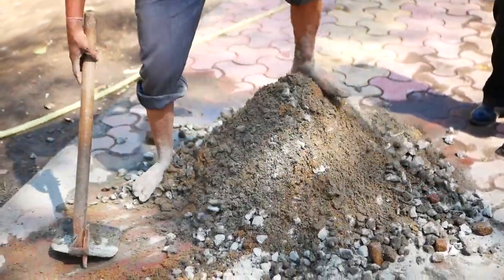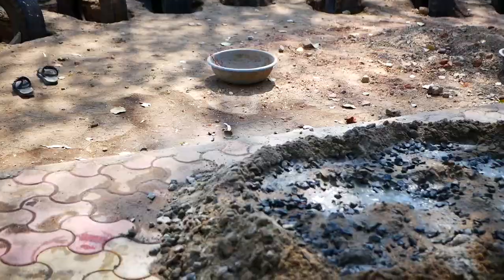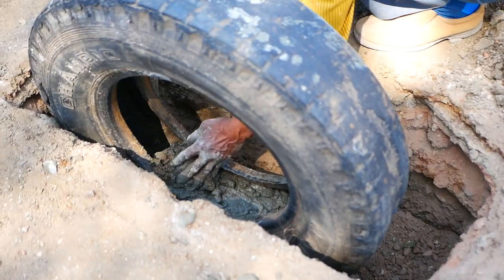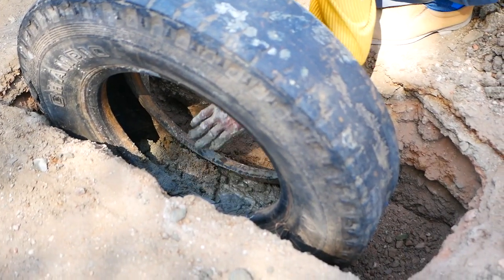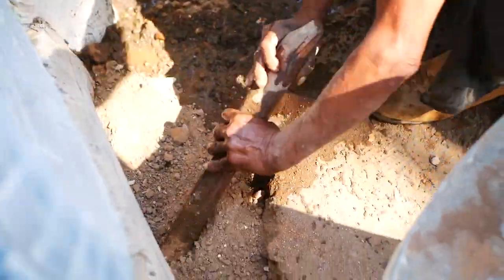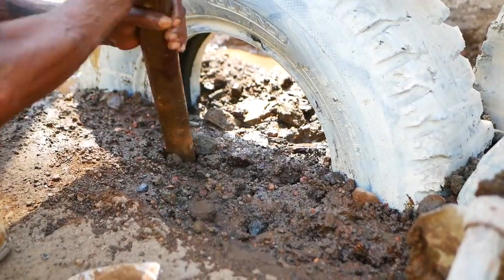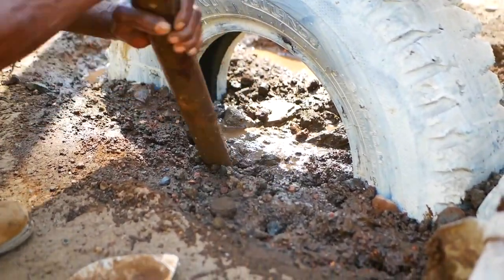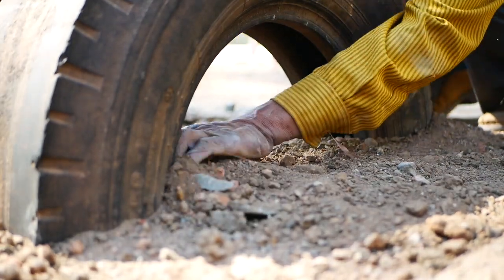Here are the guys now — they're mixing the sand, concrete, and aggregate, getting it ready to pour into the piece. We're going to pour just at the base of these tires to give them real structure, then fill that top section up with a lot of soil. When filling in the tires with your earth, make sure you use a lot of water and pack it in really, really densely.